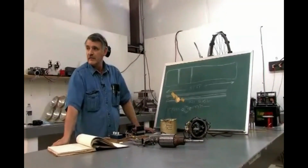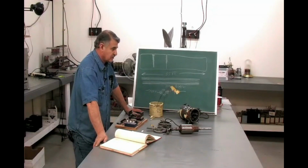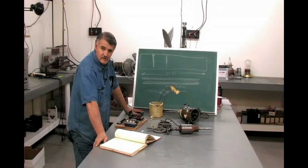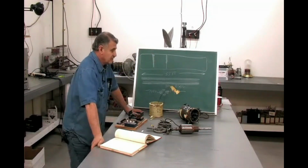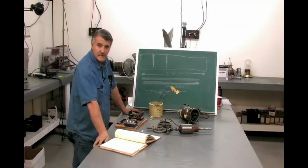Well, Adolf Hitler was working on every device known. And at that time, they didn't really have a lot of fuel. And I'm sure that they were under national security to keep the lights to a minimum, don't draw any power, same as Britain was. And this would be something that would give you 300 watts worth of light. If you're out in the pitch black, 300 watts worth of light is pretty bright, especially if you're looking yonder down some field somewhere. But the point was it would run 3 or 4 of these sealed beam car headlights with no problem at all, up to 300 watts. And I think they're 65 watts apiece. So basically there you have it.